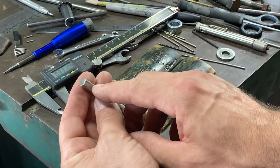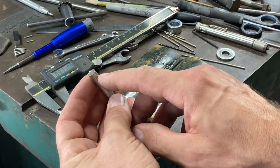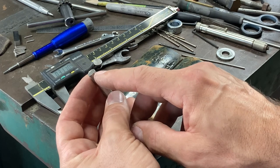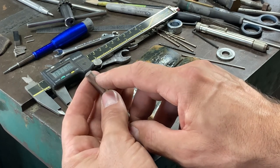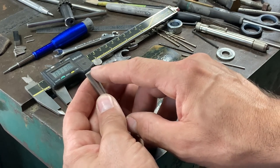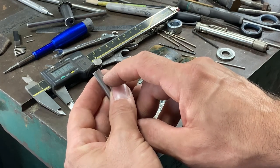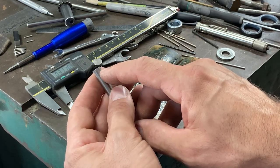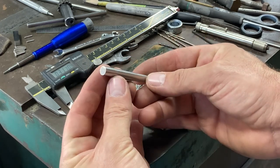we're going to need to mill some flats on this. And so now I have a number that I can shoot for in terms of how far to mill down for each flat. We'll find the surface and then we'll mill down 30 thousandths of an inch on each of 6 sides around the edge of this thing. And then hopefully we'll have good flats with fairly crisp corners, but let's see what happens.